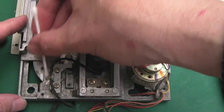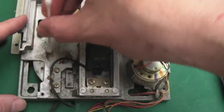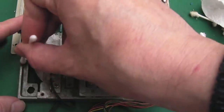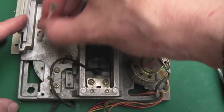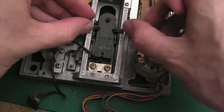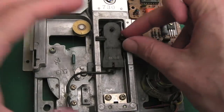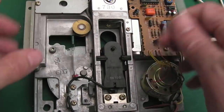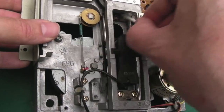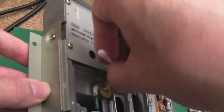The next thing is to focus with cotton buds and IPA around the drive mechanism and chassis to collect all that dust. We're not really deeply cleaning at this stage - just collecting the dust. The cotton bud being wet makes that super easy because it then sticks to the cotton bud. The aim is to just remove it all. Bear in mind you can carefully move the head up to get underneath and collect all that. It's starting to look a lot cleaner now.